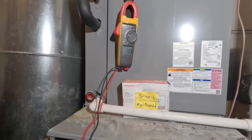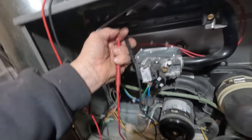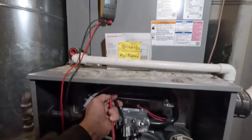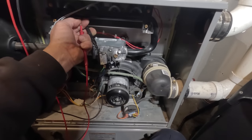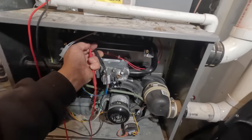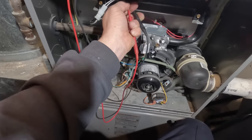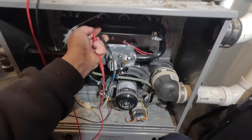What I did is I killed the furnace and pulled the flame sensor off — I've got it in my hand here. I've got one probe on the flame sensor; I want to see what I have before and after I clean it. Right now it's running and I don't hear anything gurgling in the drain. It's kind of hard to say exactly what caused this problem, so all you can do is go off what you know has been the multiple problems over and over again and eliminate those one by one.